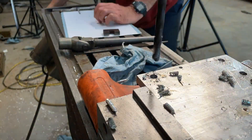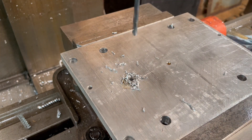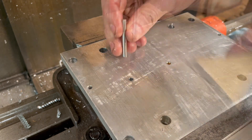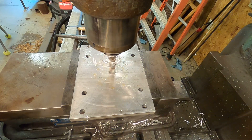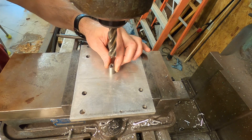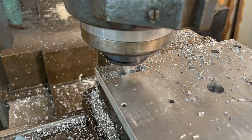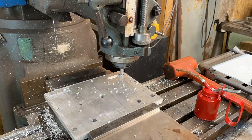Here, I'm making the base plate for the sprocket jig. It's made from half inch thick aluminum. This 3/16 inch hole will be a locating position to ensure precise alignment of the indexing plate on the chucking assembly. The center of the plate will have a 5/8 inch hole where the chucking assembly will mount and rotate. The slotted holes on the corners will allow for the entire assembly to be correctly positioned on the dividing head and clamped into place.